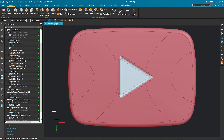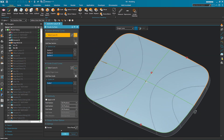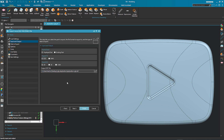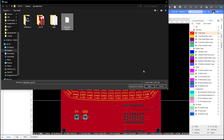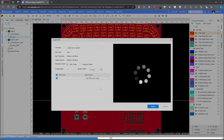First I modeled a smooth 3D play button based on the YouTube logo using surface sync tools in Siemens NX. Next I laid out the LEDs in a 13x9 grid and exported the DXF from Siemens NX to import into EasyEDA. This made it easy to place the WS2812B LEDs accurately on the PCB layout.